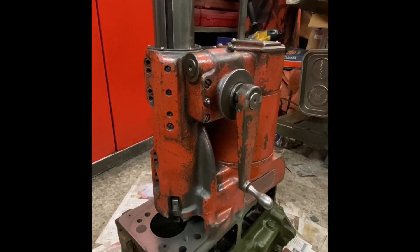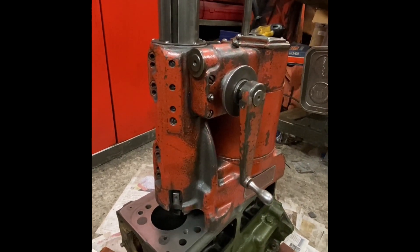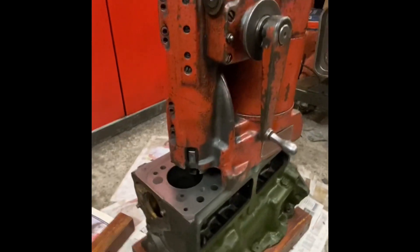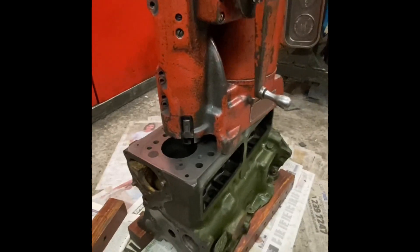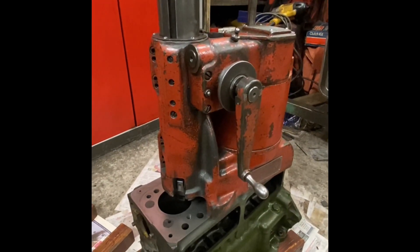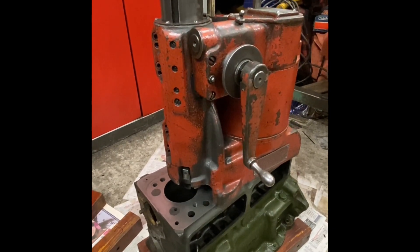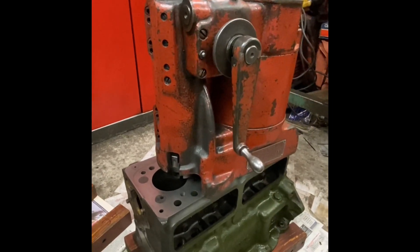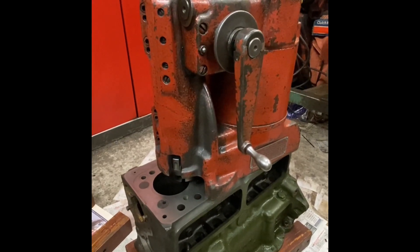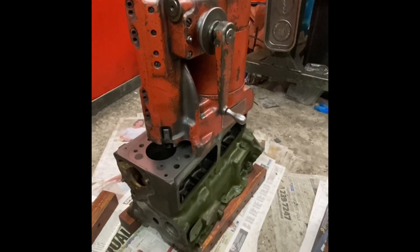The beauty about this little machine is because it's so small it's easy to use. There are a couple of little drawbacks — one of which is, as you've probably noticed, it mounts to the block. Now, obviously if the top of the block isn't square to the axis of the main bearings, you will quickly find that you'll bore your cylinders not square. So you must ensure that the top face of the block is actually parallel to the mains. On these A-series for example, there can be a good few thousandths of an inch out, so a cursory skim is sometimes needed on the milling machine to get that nice and square before the boring machine can be mounted.